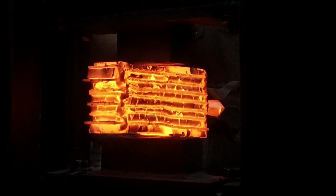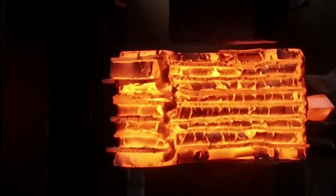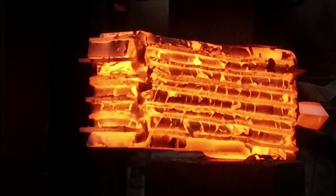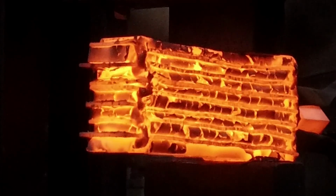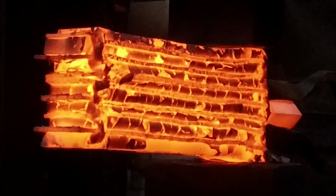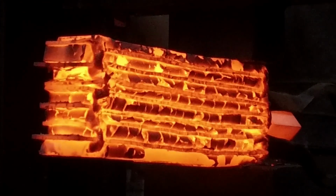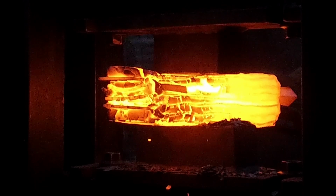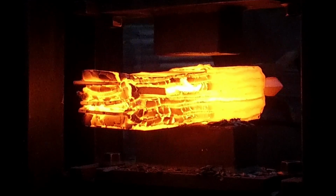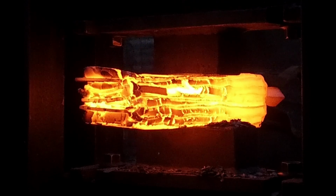This is the exciting, sort of satisfying part about the filming and making of the Damascus. I'm using the hydraulic press to compress those layers and draw the bar down into a nice narrow section. Once the bar is all forged out to dimension, I draw it out to a longer section, and it will probably go under the power hammer after this to get a more uniform profile.